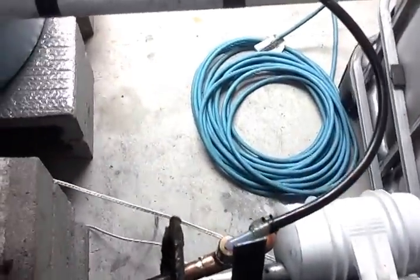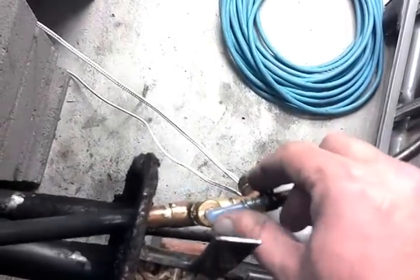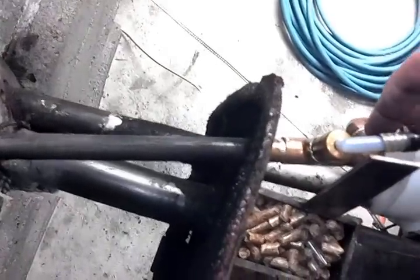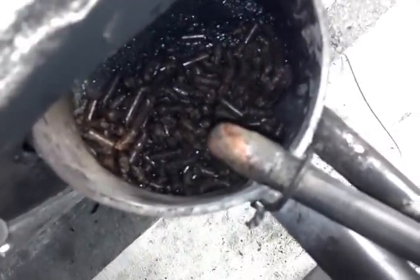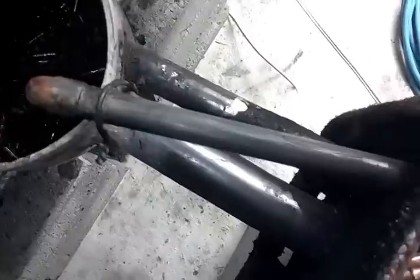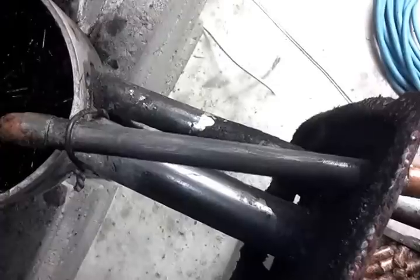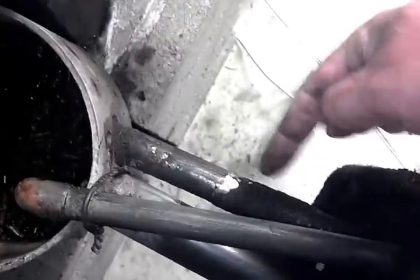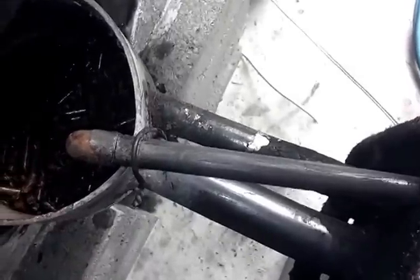I've also changed my oil feed just a little bit. My oil line still comes in here, but now it's connected to a little vinyl elbow and it goes into a copper line, and it comes over here and drops down on top of the pellets. I needed to fix the problem I had with the previous quarter-inch copper line plugging up from too much heat baking the oil in there, but I also needed more air into the burn pot. Not only do I have air coming in on this one down here, I also have air coming in here as the oil drips in.